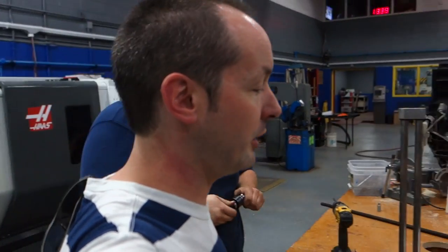What the hell are you doing with that big capacitor? That's your motor starter right there. Well, you know they come in different sizes, right? That's what we get. You can't just guess. You have to look up the motor. I have exactly what it is. It's a 12.5 UF. Microfarad is what you're trying to say. Okay, at what voltage?